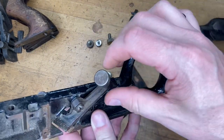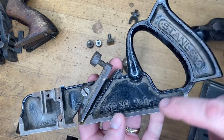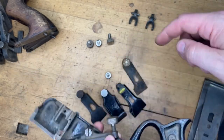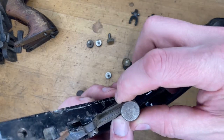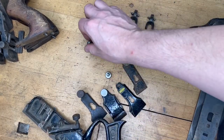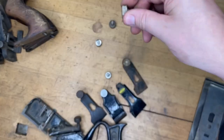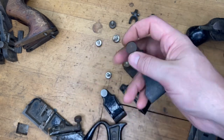To add more information: the screws for the number 39 series — this is a dedicated dado plane that came in various sizes from a quarter inch up through one inch — once again the diameter and thread pitch are the same, so these are interchangeable with the number 78s and number 40s. The number 40 and 40-and-a-half will have a longer screw. Some vintages of the 39 actually put the logo or trademark on the screw, so there's a Stanley Sweetheart from the 1920s or early 1930s, and my favorite — the V logo.